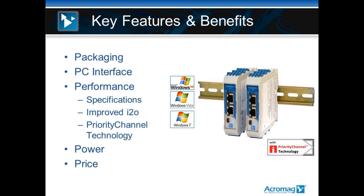On the performance and specification side, this whole line is designed for -40 to 70 degrees C operating temperature. Looking at the unit, you see two Ethernet ports. Those two ports allow users with more than one module in a zone to eliminate the need for a five-port switch, because they can daisy chain the modules at the Ethernet port level. These units are thinner than existing bus works and eliminate the need for a local switch.